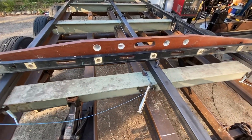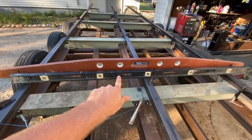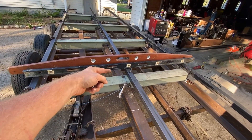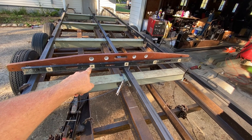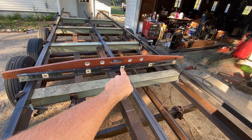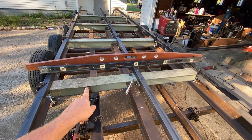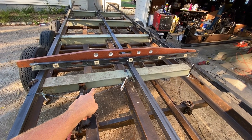I've got three 2x2s on here now to make sure they're all tied together, and then I'm going to get them all level. I've got a couple levels here so I can verify that they're all flat. I noticed this one, if I flip it over, it doesn't read the same as when it's on one way. So I've got this level here dead center, and this one in the spot that it also says dead center, so hopefully two or three readings there is good. I've got the jack under here to get this level, and now I'm just going to put some tack welds right there and right here on the angle iron on the trailer.